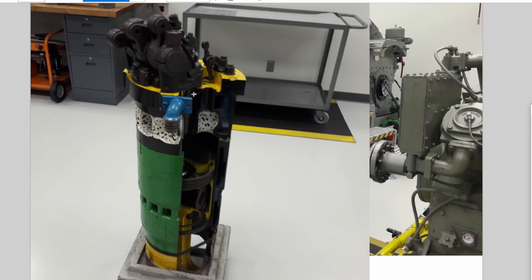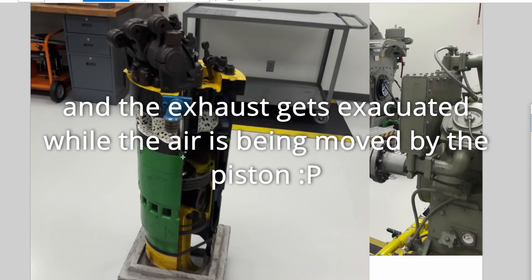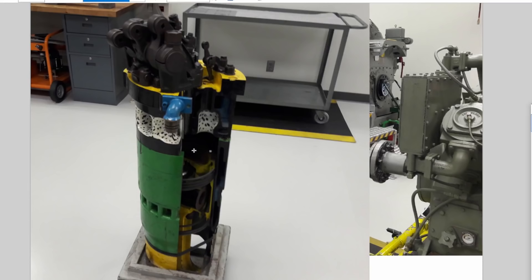The EMD is a two-stroke design. When the piston gets all the way down, intake air runs through ports in the liner. It then gets compressed all the way up to the top, where it compression-ignites — there's no spark plug, no glow plug — just the physical compression of the fuel squirted in from the injector on top, plus the air, is enough to detonate and send the piston down on the power stroke. Then you get intake again, and as it squeezes back up, exhaust valves on top open so fresh air helps scavenge out the exhaust in the same stroke.